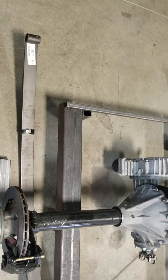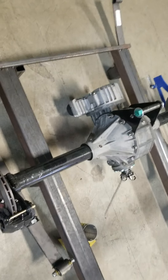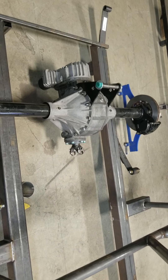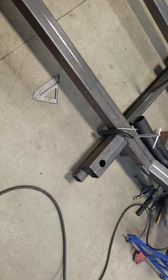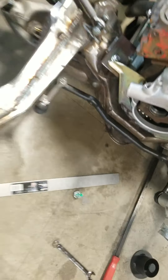One of the next things we'll do is figure out back here on the rear frame rails where we're going to cut that off and then start angling it uphill. This car is going to be really unique in that the headers will come down, and somewhere in this area in front of the rear end we're going to tie the header tubes right into the three-by-four. Then the exhaust will actually exit the car through the brake light panel on the back.